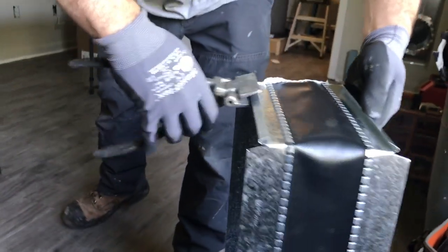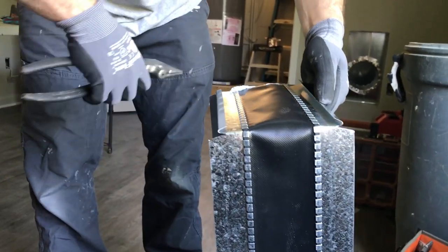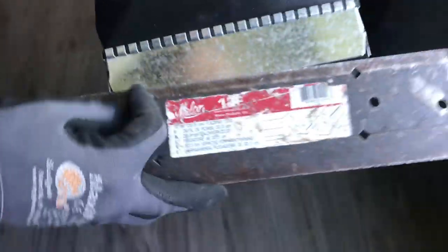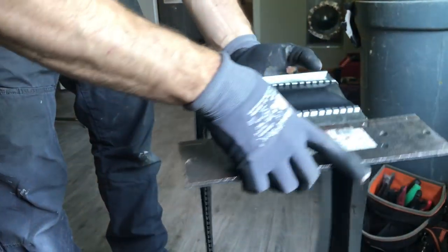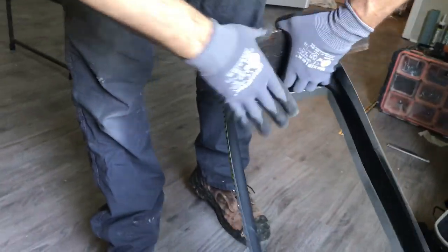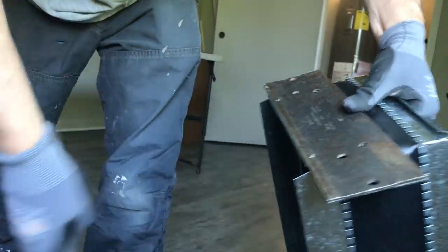You don't want to clamp down too tight — you need enough room for your drive connector to get in there, but you don't want it sticking out too far. Insert it fully, visually check, and squeeze it, putting all the pressure right there. Clamp it in place, put pressure with your thumb, fold it, and squeeze it down. You can also squeeze it down with your tongs while it's on for a beautiful almost factory-looking ear.